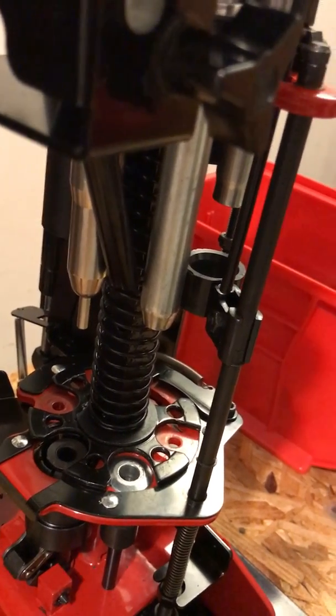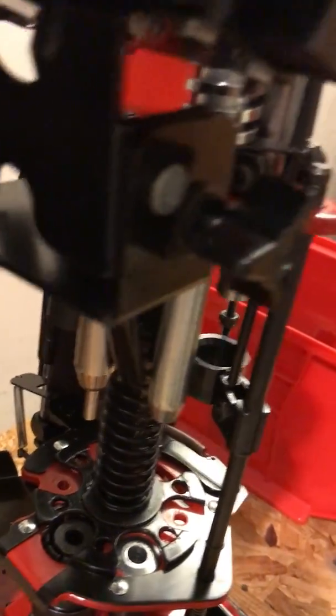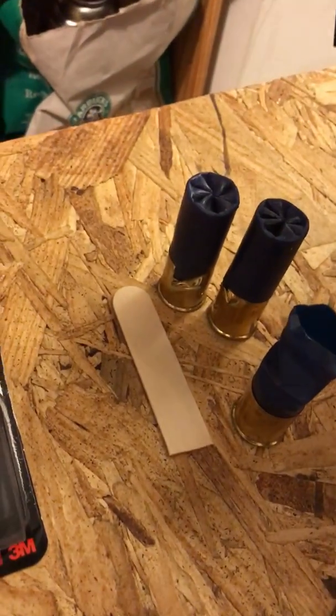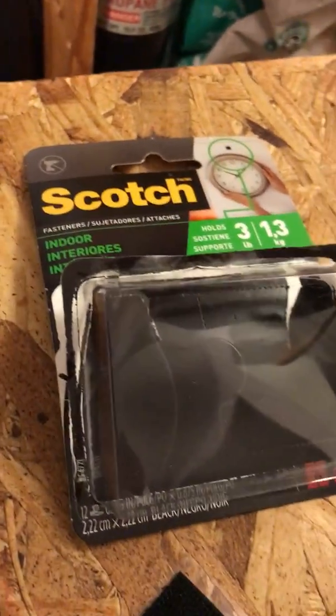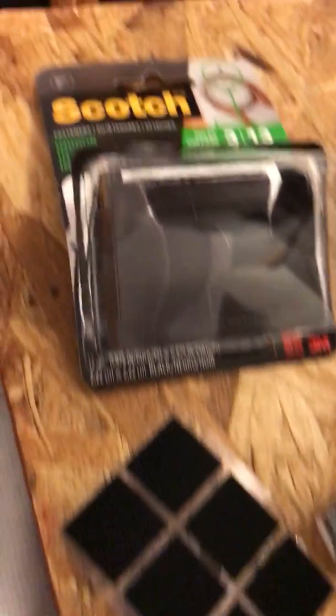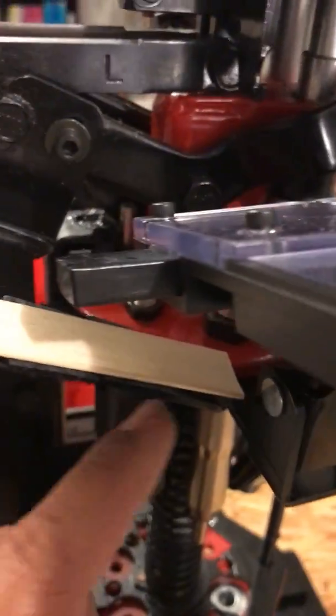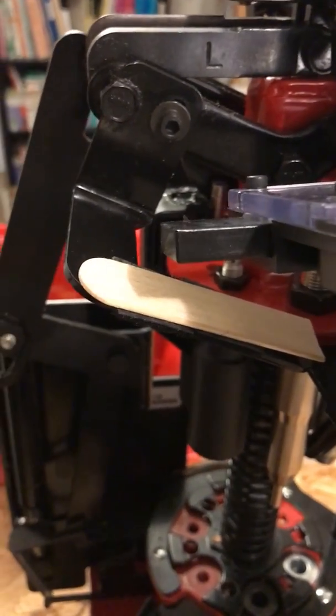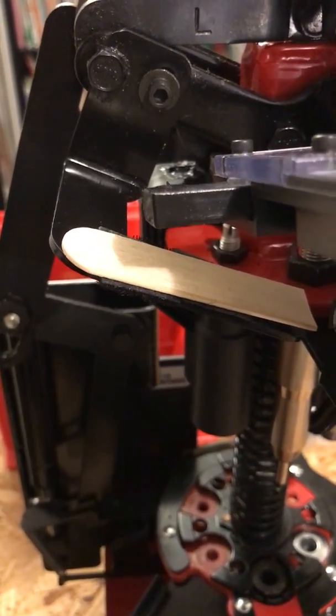The only way I could get this to work correctly, where it's not catching the holes on either the depriming side or the stage 2 side, was to position it more in the middle. But then the bar that presses on it would never catch because it's too far away — it's not flush. So my solution was to get a tongue depressor, cut it in half, buy some velcro tape, put it on the actuator bar, and put the other part on the tongue depressor. That gave me an extra edge on the side of the actuator bar.